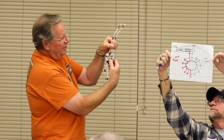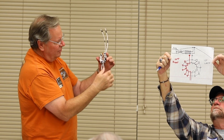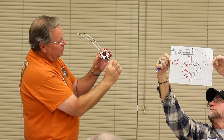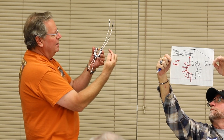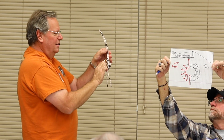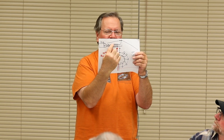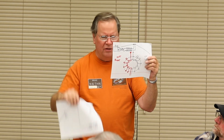So the red wire goes in the top, turns clockwise 10 times, and comes out on the bottom. The other side is a left-hand turn: you put the wire in and wind left-hand, left-hand, left-hand. On the last turn it comes around and comes out the bottom — so 10 turns here, 10 turns there. That electrically makes your rig talk without interference on your coax to your dipole, which is raised about 30 feet.